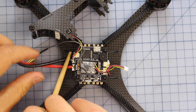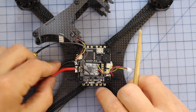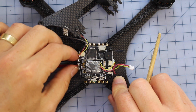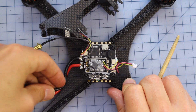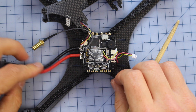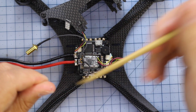That's exactly where you hook up your XT60 connector. One thing I notice — there's no strain relief. We really need some way of securing this down with a little zip tie, because if you're in a hard crash and your battery gets jettisoned, it's just going to rip it straight off the pads and might even break your board. A little bit of strain relief — I'm going to end up zip tying mine to the arms. That could be a little bit of a trap for new pilots.